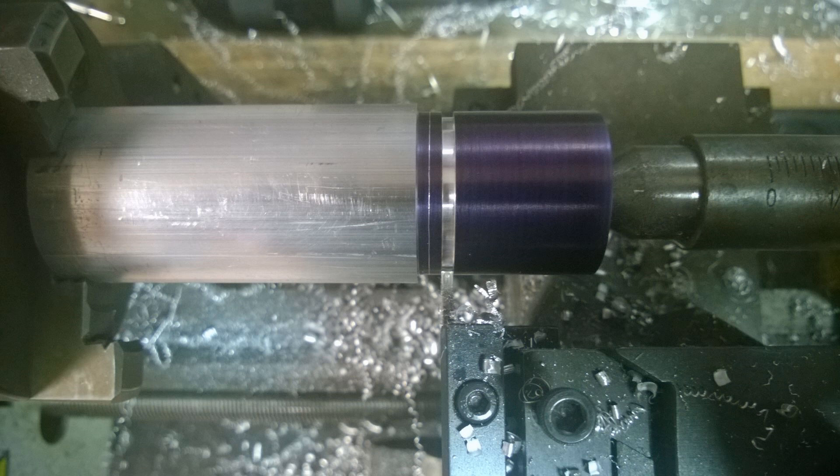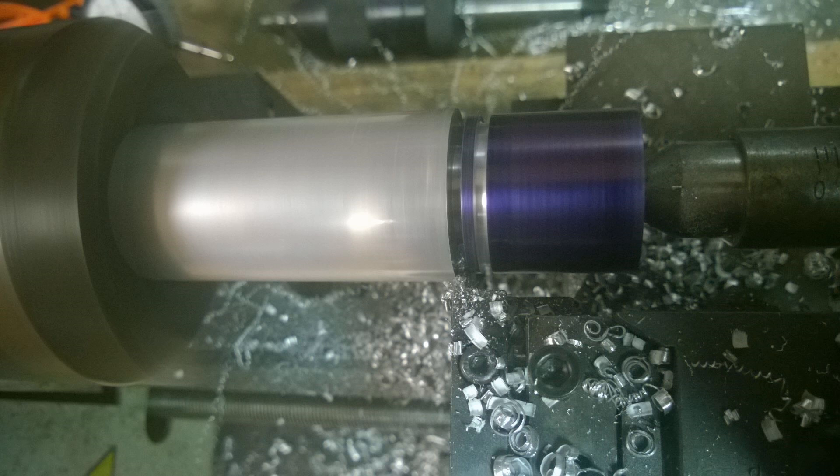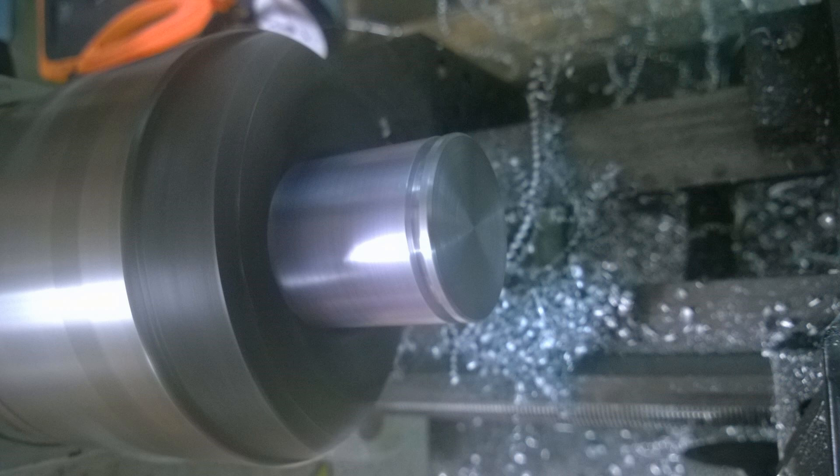I then use the parting off tool — I think this is a 1.6mm parting tool, which is tiny, not what I usually use. I usually do a lot heavier machining, but needs must on this small underpowered machine. Anyway, I machine the piston ring groove to the depth required. We've only done one groove for this particular engine, but we have the ability to add two or more in the future. Then I just part that off.